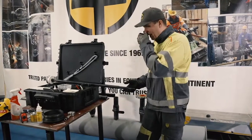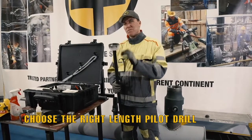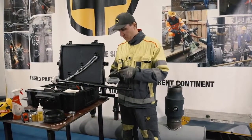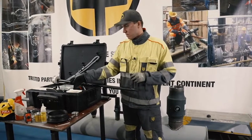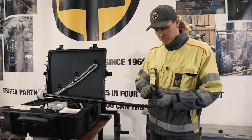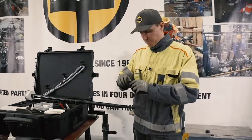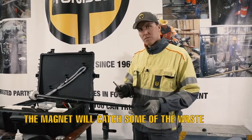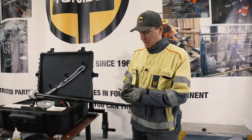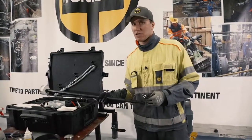Now we just need a pilot drill. For this drilling, because the cutter is not so long, we're going to choose the normal pilot drill. Before we insert the pilot drill, we want to put the magnet on the pilot drill. The magnet will take some of the waste that comes from the cutting and force it to stay in the cutter, so that it does not make any harm to the sealings of the valve.